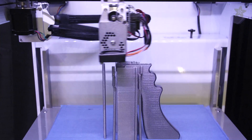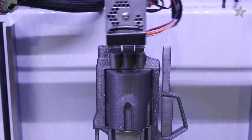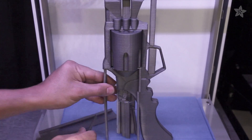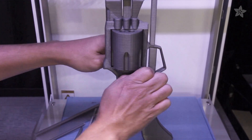The parts are printed on our Type A Machine's Series 1 3D printer. The 0.4mm nozzle can output highly detailed parts with excellent precision. Its enormous build area lets you print cubes measuring 305mm. Use PLA for large accurate prints to keep warping down to a minimum.